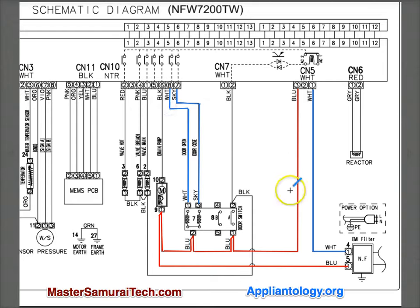What about the case of the switch over here? What do switches do? If we were to put line and then neutral over on the other side of the switch and the switch closes, that's called a dead short. Therefore, with the switch, we know it is switching whichever one is coming in. Since we have line coming in on this side, we know this has to be line coming out here and on through, serving these other loads.